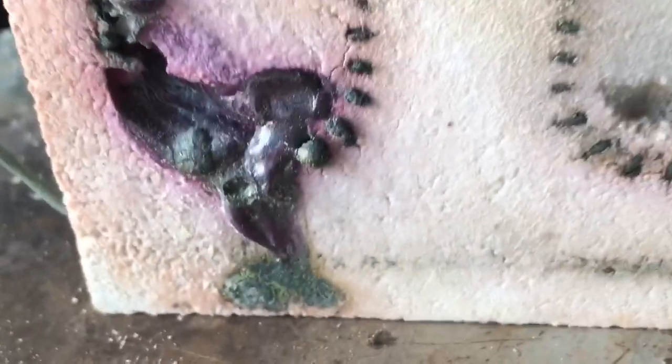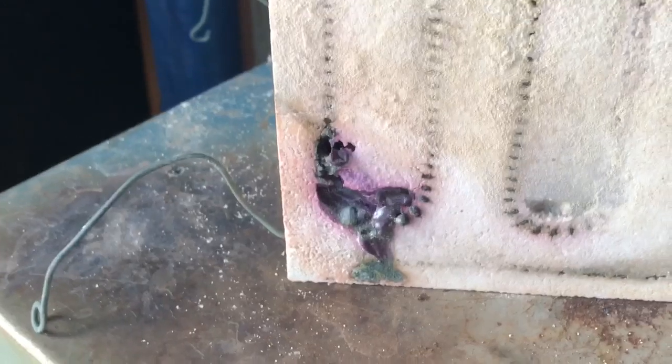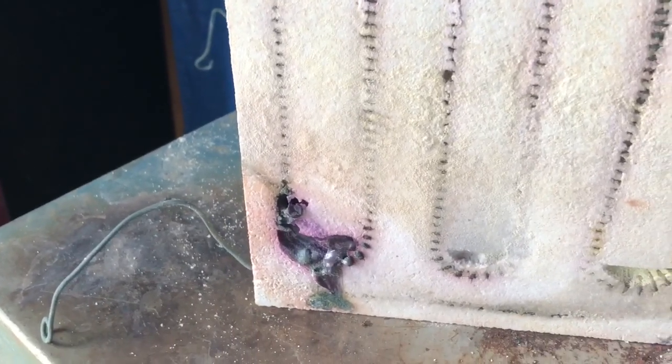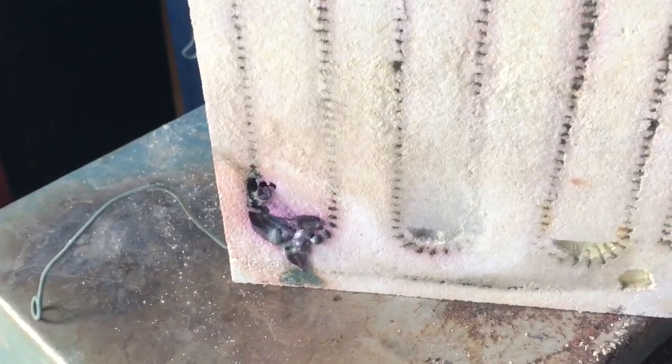And here you can see where the salt burned through and caught the coil. My hope is that I can cut this corner away and join this side to that side, only losing maybe six inches of coil, and still be able to make it work — especially if I pulse it at the hottest settings instead of running continually, so the coil doesn't get quite the amperage. It should average out and not overheat, maybe.